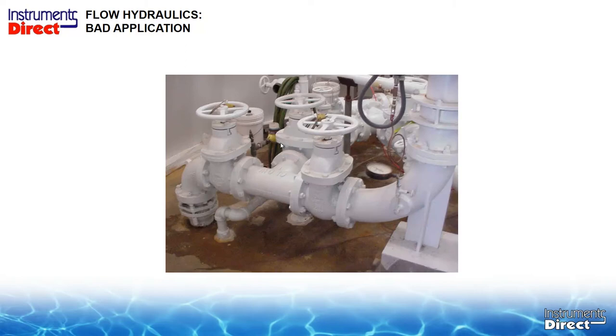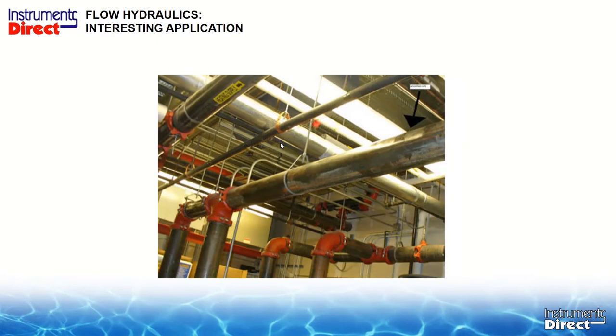Occasionally in big box stores or similar applications you'll find fancy blue or red push-fit connectors that do a nice job, but the problem is the way they connect to the pipe — sometimes they ferrule the end of the pipe, which makes a very disruptive flow profile. The 10 to 15 pipe diameters rule is based on elbow to elbow. If you have something more disruptive like these connectors, you'll need more straight run of pipe to get far enough downstream from the turbulence to achieve a symmetrical flow profile.